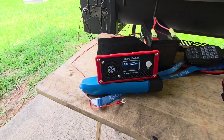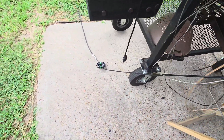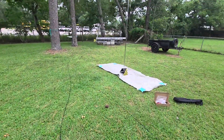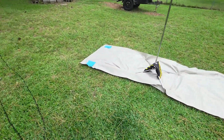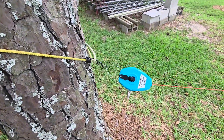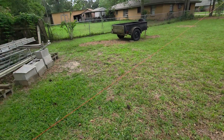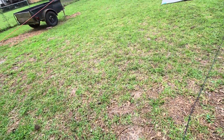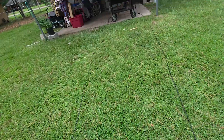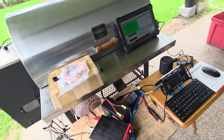Let me show you what I've got. I've got the radio, and I tried this ground wire just for experimentation — it didn't make any difference. The amp's on a battery, running down here to a choke, and then from there it's running out to the vertical. This is the real portable antenna, end-fed half-wave — what I normally use a lot when I go out, going up to about 20 to 24 feet in a sloper configuration. As you can see, that works perfectly fine. I apologize for the clutter set up in front of my grill, but it was just the easiest thing to set up.